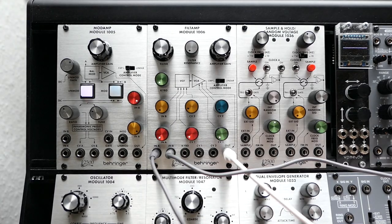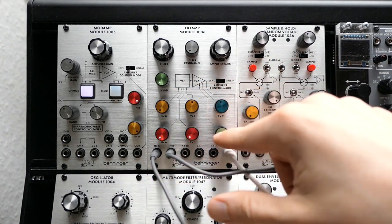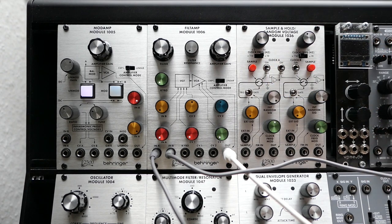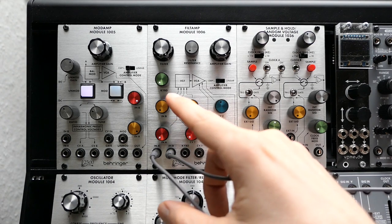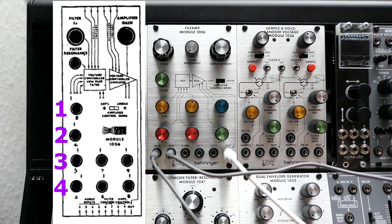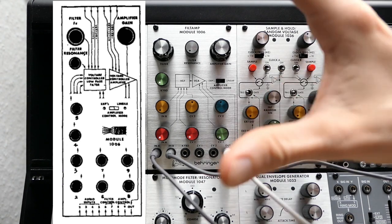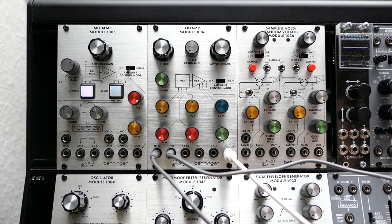It has a very unique design with a simplified circuit printed on the front plate, which not only looks good but also helps us quickly identify which inputs go to which part of the internal circuits. One has to get used to the arrangement of the colored attenuators, especially since the attenuator for input B is above the one for input A. This follows the original, though the original module had four audio inputs. The original modules were much larger, so Behringer had to find a compromise to fit them into the Eurorack format. If you're interested, have a look at a quick impro that I recorded with it — the link is in the description. Thanks for watching and stay tuned.